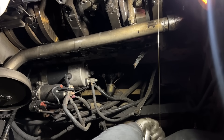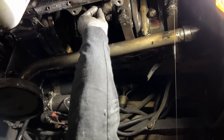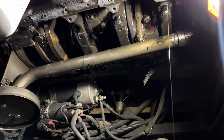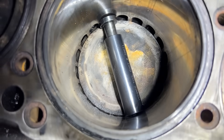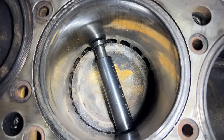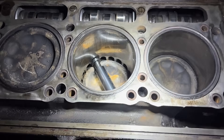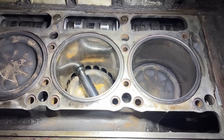Is that oil still coming out of that pressure relief valve? Yeah. I got a liner puller tool in there that goes straight across, sticks out on those liner points, and then we can use the piston to drive the liner up and out. So as Jonathan rotates the engine over, that should push the liner up out of there.